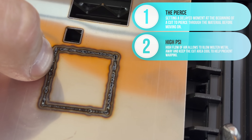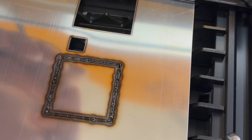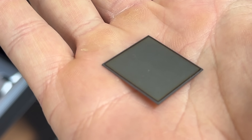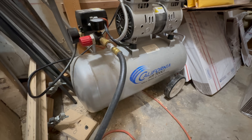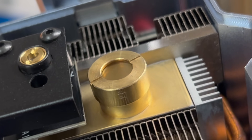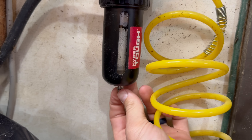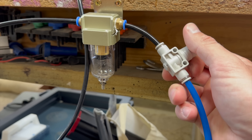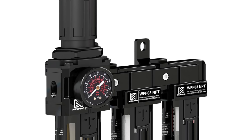Number two: high PSI. You need a high flow of air to blow away molten metal. With the stock air assist on its highest setting, the molten metal just builds up, creating a mess and lots of slag. In comparison, here is the same thickness metal with 40 PSI of constant airflow. I use an 8-gallon California air compressor, which is super quiet, but any compressor creates condensation that can build up on the lens and block the beam — so you must also have a water-to-air separator. On a particularly humid day in Georgia, one separator wasn't enough, so I'll add a link in the description to a recommended all-in-one unit.